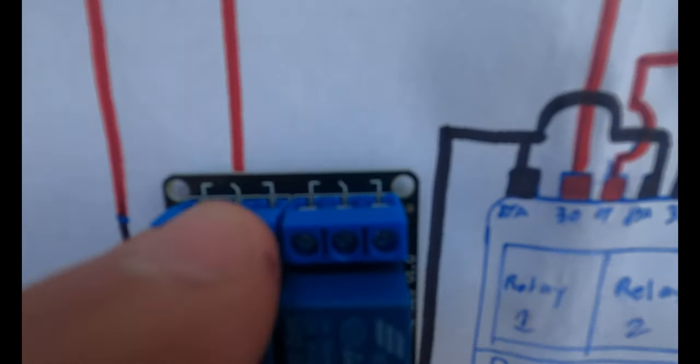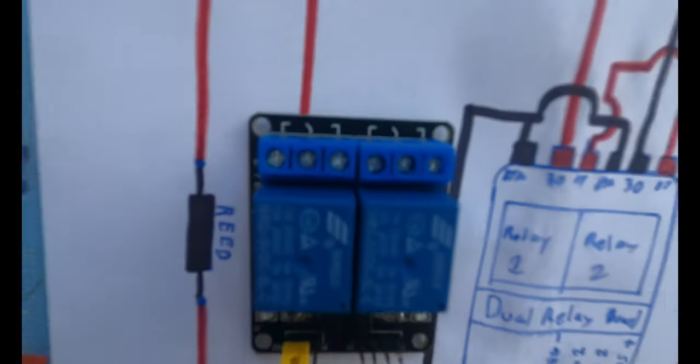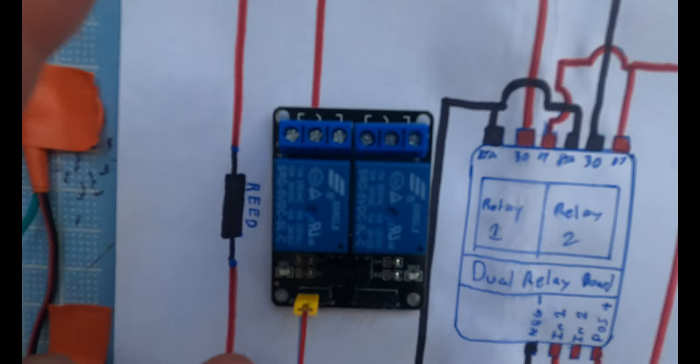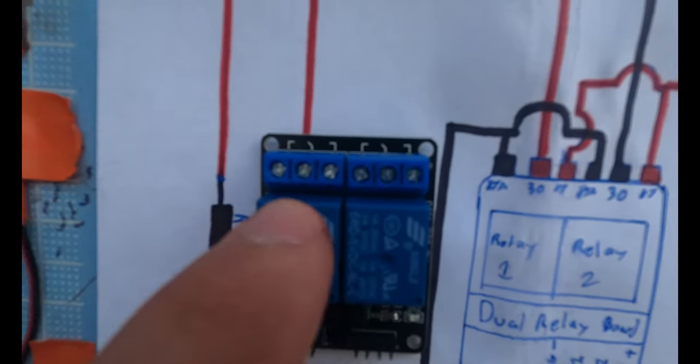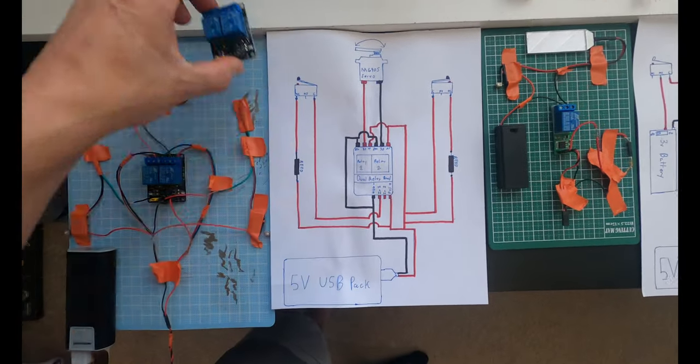And I don't know if you guys can see those white lines. This is for relay side 1, and you can see the middle white line is tilted over to the left. That means that's the circuit it's normally touching. So this first and second contact here are actually touching each other right now until you put power to them and the relay switches over and the second and third contact will be touching. So relays are fun. I hope you guys can understand them.